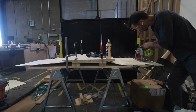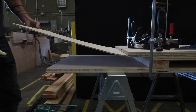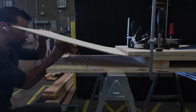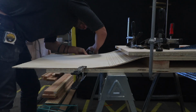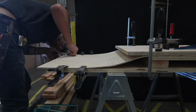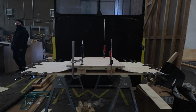Now I had overcut the thinner plywood, so I just had to trim some so that I could clamp it along the edges. This is a quick and easy DIY project, but the one area where I was careful was in applying the glue. I don't want to have to try to sand in those tight cracks, so I made sure to keep the glue only in the places where I am clamping the 1/4 inch plywood to the 3/4 inch plywood.